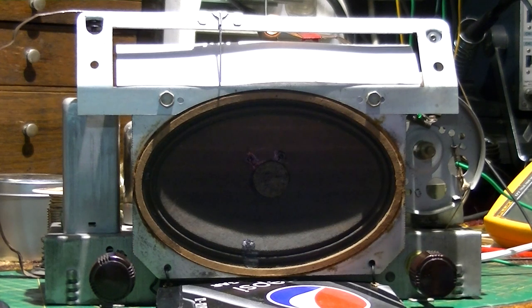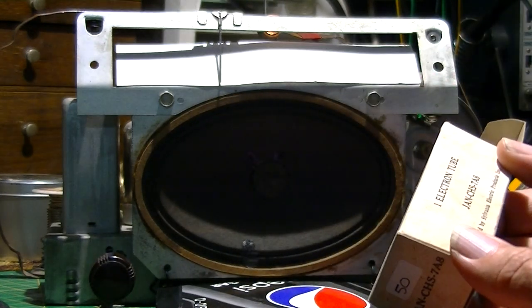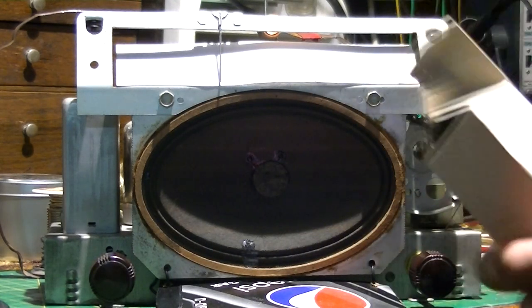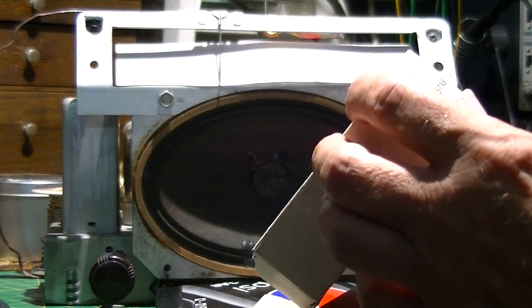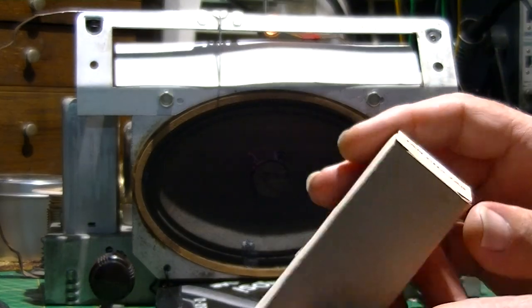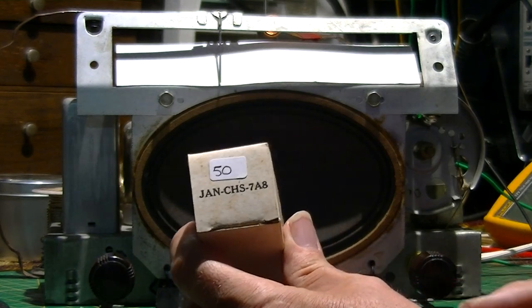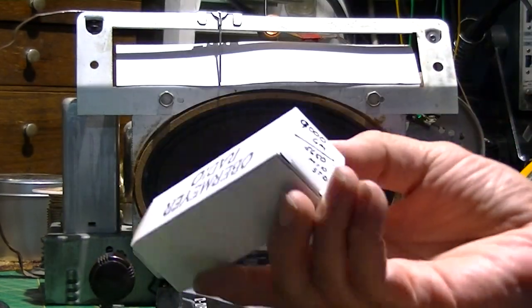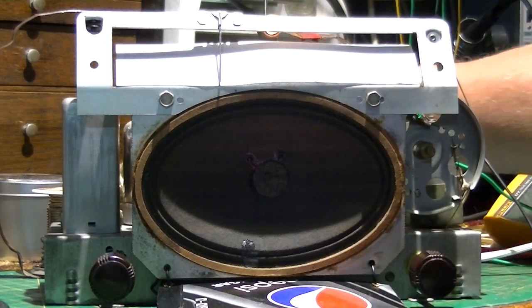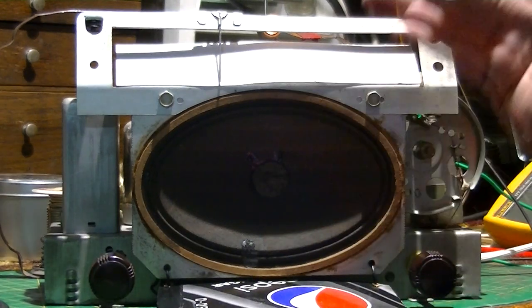I thought they'd be more expensive. I got a Sylvania - I love Sylvania. This is a joint Army-Navy Sylvania 7A8. And then this was the 50A5 output tube that was shorted - that's why I was getting bad hum after I changed the filters, and I didn't even have volume control. And this is the original 7A8 that came out of there.